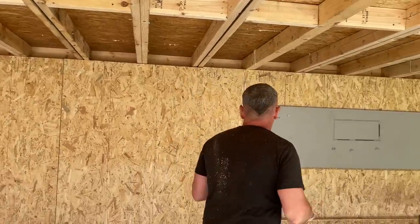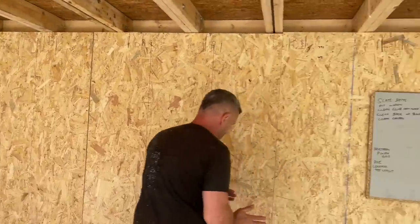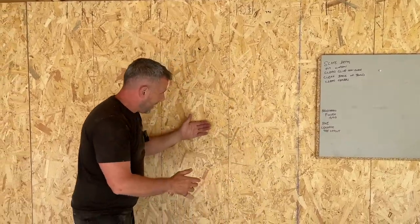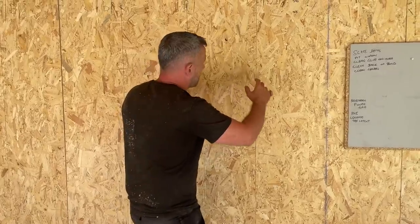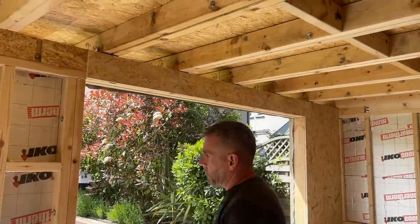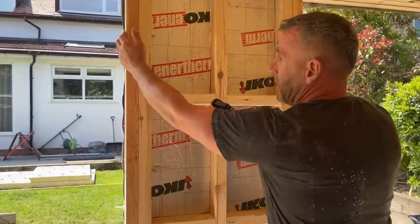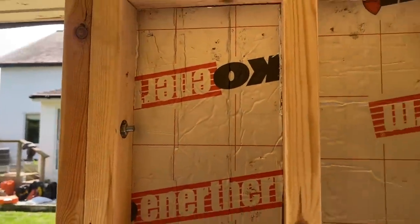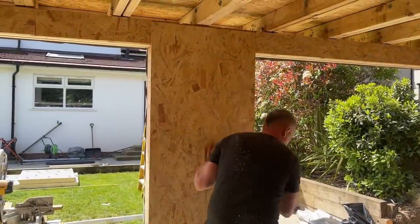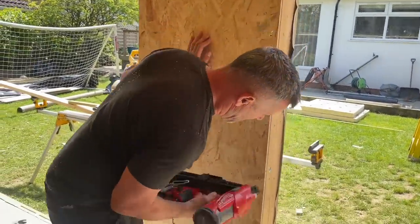The back wall is sandwiched - it's practically like a SIP panel where you've got insulation between two OSB sheets, but obviously we've got our timber frame under there. We've got OSB on the outside and OSB on the inside sandwiched together - it's absolutely solid and takes the weight of that full roof bearing down on it. We've done exactly the same with the front. With these nibs we've got a double timber on each side of the nib and another timber there, all 5x2 and all bolted together. The outside has OSB on it and the inside will have OSB on as well, which adds more additional strength.